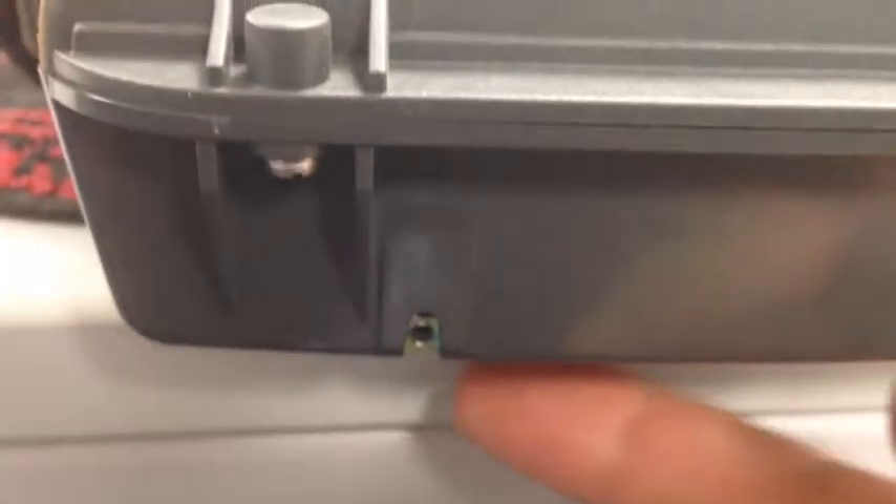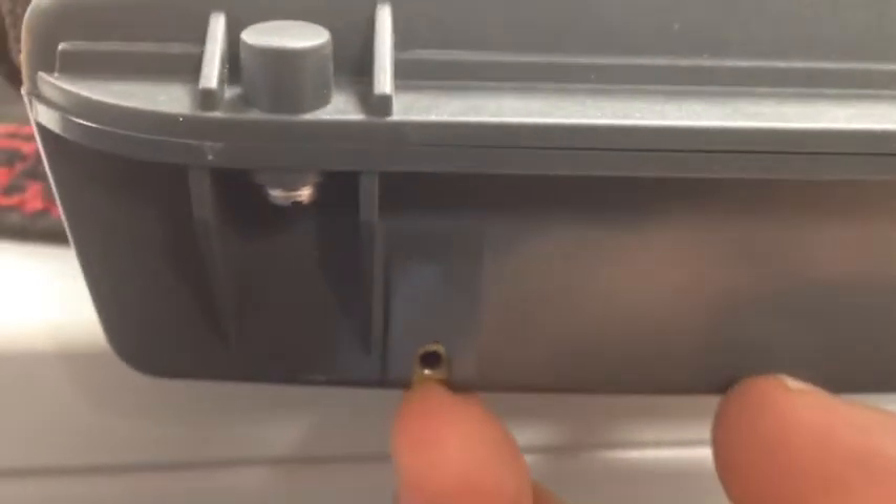It can be that there is a problem with these screws. You can see here that the nut, the thread, has gone. And this one is also very thin — on the limit. Just something to watch out for. I think it's probably a design fault. The square nut there is very thin and is also in a slot here, so very easily the thread can be stripped.